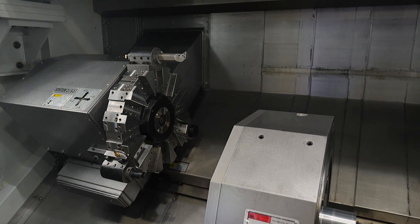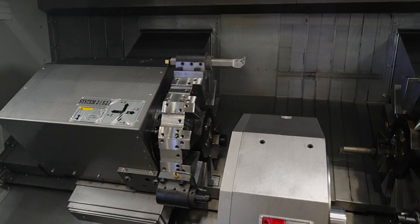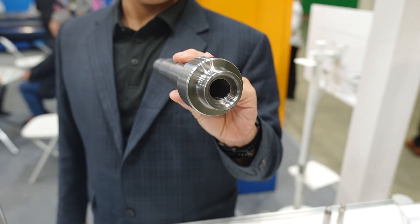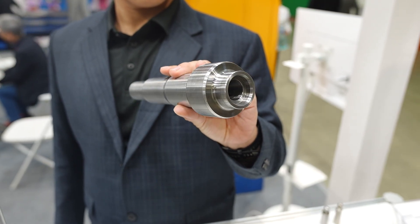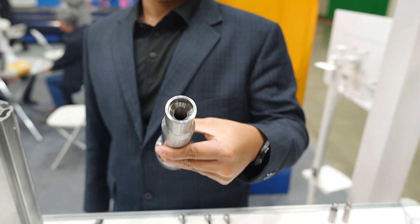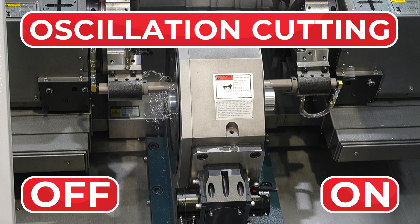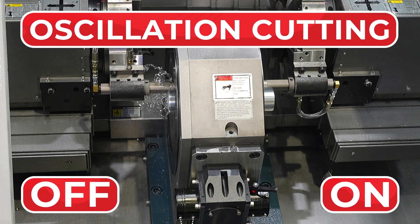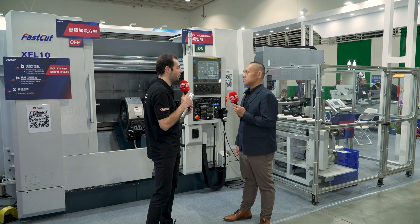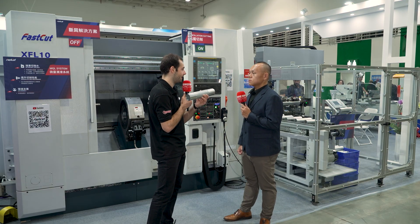You've essentially got two lathes put together with driven tooling — you can do outer diameter turning. Exactly. The two turrets are controlled by two independent systems, so we can program different operations on different turrets. Customers need this for higher runout accuracy on their shafts and for faster cycle times. With conventional methods they need a face-drive center for the next operation, but with the FastCut center drive, both ends are already turned — they just clamp the turned OD and do a deeper cut to finish the rest of the operations.